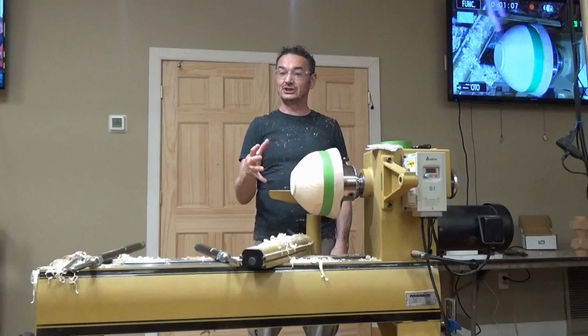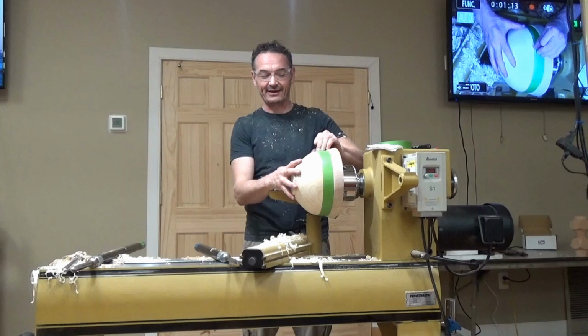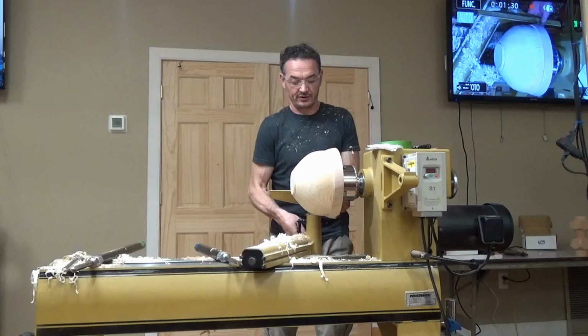So all I did was, I've done it before, I've been impatient, I've gone, oh, I've got the good fit, and I push it all the way up tight, and it cracks. But just by waiting a handful of seconds, 15, 20 seconds, the bowl could take the extra pressure. It's just being nice to it. See, it didn't crack. And ash is really vulnerable to cracking. You know that. It was cracking while I was turning it.